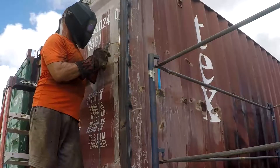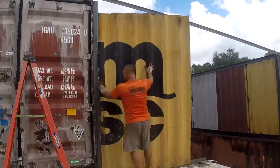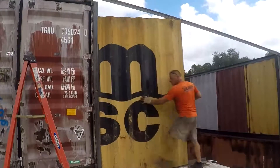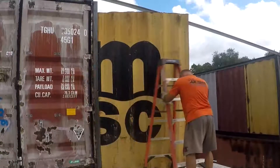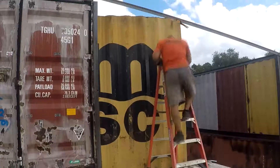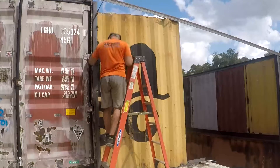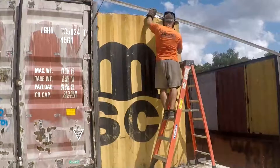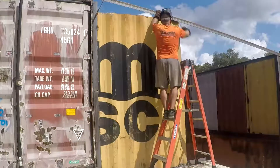Here I'm putting the angle iron on the second floor — stick welding is still kind of a pain, especially vertical. Here you see me putting the first panel up. It was a little windy and I was doing it by myself. We have the scaffold on the other side so it won't fall in. I should have welded a triangle piece to the panel before putting it up, but I did it afterward on this first one, which was harder. So from this one onward we weld the panels together first and then shove them up on the wall.